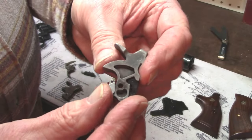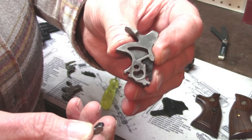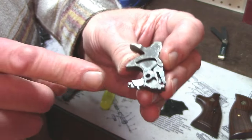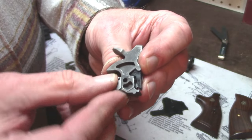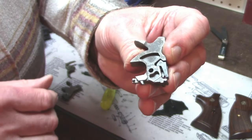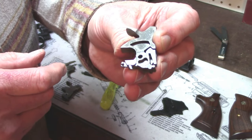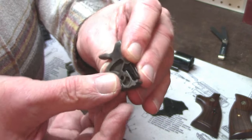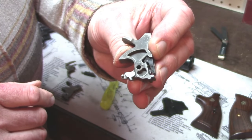Here's a close-up look at that hammer. One thing I think is very intelligent design change was the incorporation of a quick-attaching stirrup. That's what this is right here — this is the stirrup that connects to your main spring that drives the hammer. In the old style, that stirrup was connected with a pin that had to be driven into place, and sometimes it cramped up or stuck on the side of the frame or side plate. Now we have a stirrup that simply sits in a keyway. It's an intelligent engineering change.